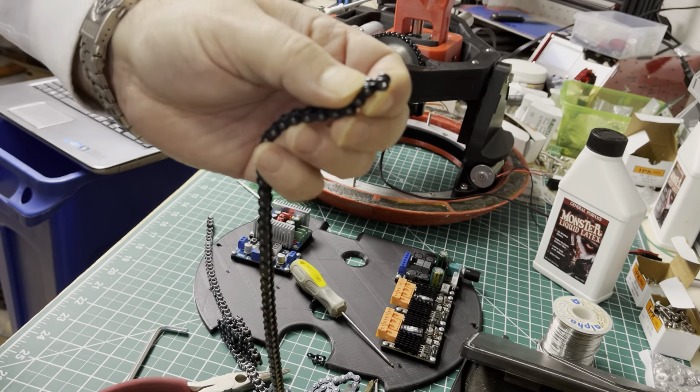The two outers will go over it — that's how I'll do it. I use a chain breaker; Servo City sells these, it's about $21. You basically put a key in it, and when you put the chain in where you want to break it, you align it to the line here. You turn this and it pushes the pin out of the chain so you can take it apart.